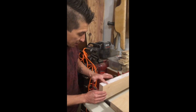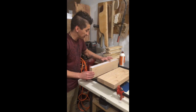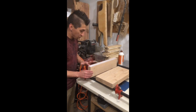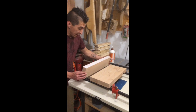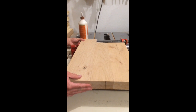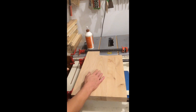The amount of time it takes glue to set enough to remove from the clamps matters because most shops only have so many clamps, and you might need more to meet your production goals for the day or the week. If your joinery is good and your glue technique is solid, you only need to let these things sit in the clamps for 30 minutes or so.